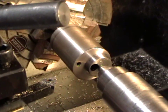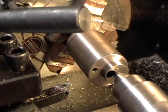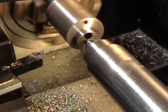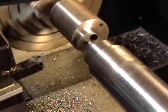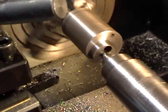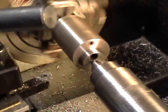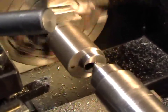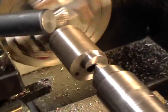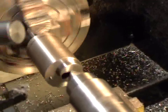As you can see it's quite possible — takes a bit of time and a lot of patience. I'll leave it set up like this because now I have to cut the eccentric on the other end. If I leave it like this, the opposite end will have the same eccentricity and therefore it will match perfectly — holes and everything. When that's done, I'll set it up back in the three-jaw chuck, make sure it's centered, and then we can start parting off the separate discs.